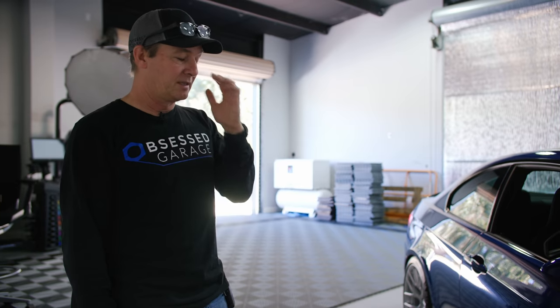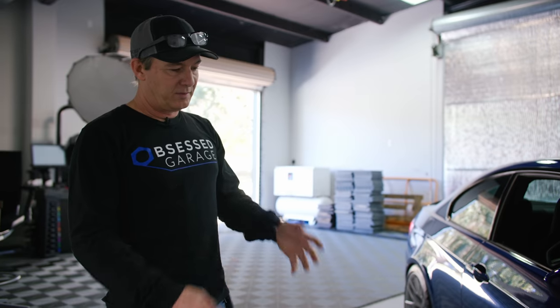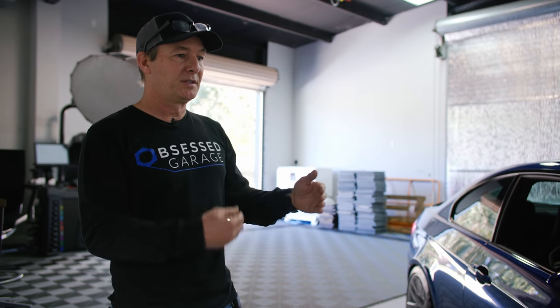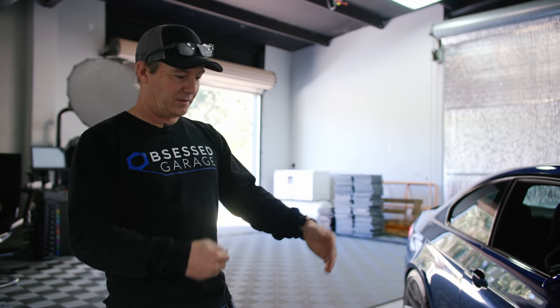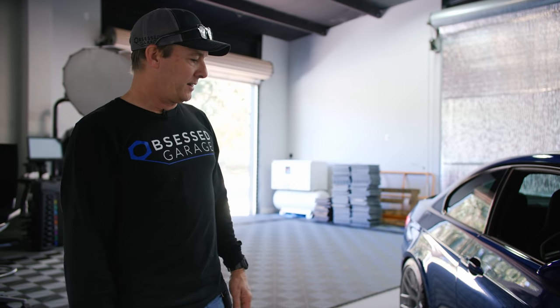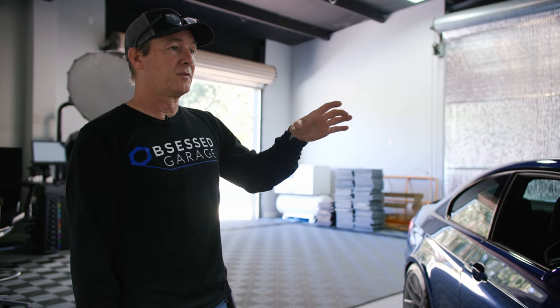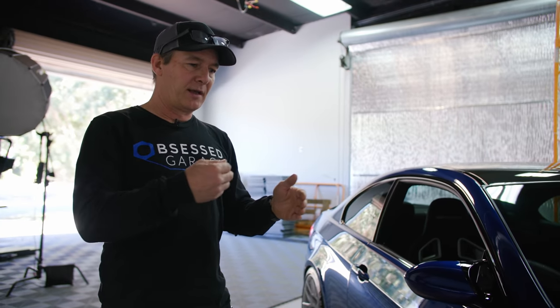I don't know what the purpose is for that, but when we did the last one, we thought on this one we're going to tighten it up a little bit. So we're going to be about 26 and a half inches on each scissor opening for the foundation, and 82 inches long. And then, like I said, 33 inches apart is what the scissor calls for, scissor to scissor. I factored in a half an inch on either side of gap.